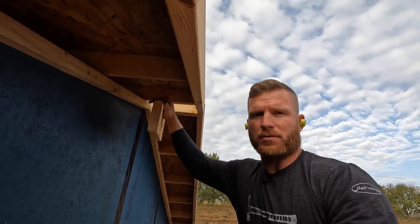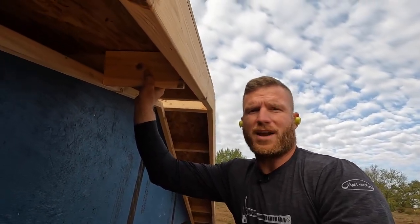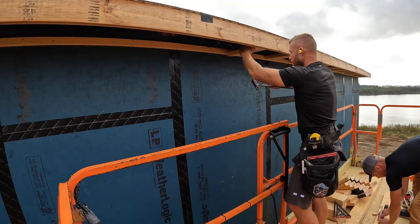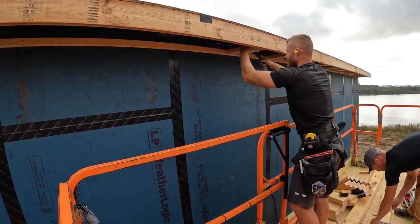If you look under here, all of my purlins are two feet on center, so we went ahead and took some scrap blocks and we're going to screw those right into our purlins, giving ourselves a place to add some nails in the center of that soffit. I've worked with SmartSide - it probably won't sag too much since it's a wood product, but over time at 16 inches you could get a little sag in the middle. This is an easy way - we've got all these scraps anyway. We're going to run around the perimeter of this building and install a block every two feet.